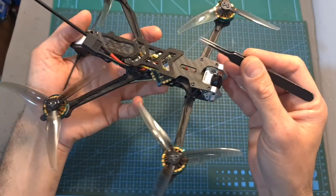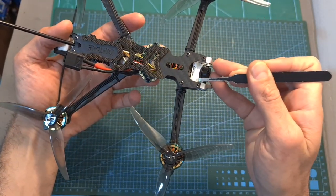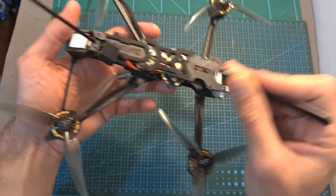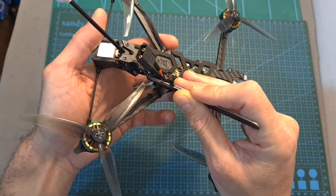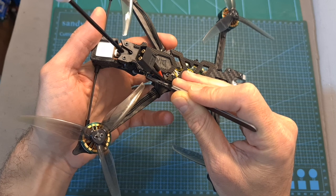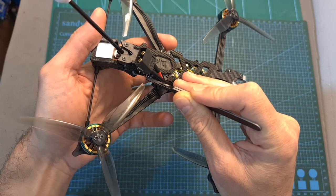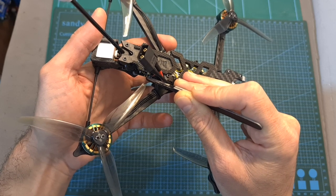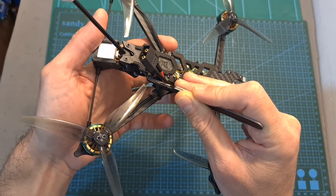And since I've got the analog version, on the front of the frame you can find a MAMBA rebranded version of the Runcam Phoenix 2 FPV camera, and on the back of the frame the DIATONE Ultra Tiny, a 20x20mm 37 channels VTX that supports IRC Tramp protocol, uses an IPX antenna connector, and has a selectable output power of 25, 100, 200 and 400 milliwatts.